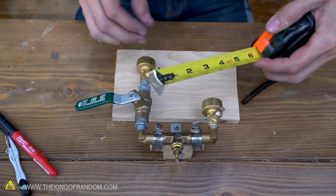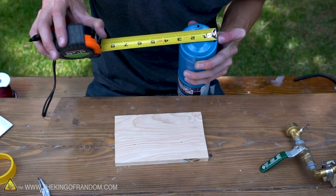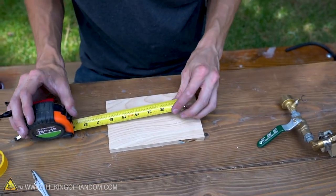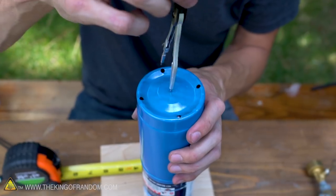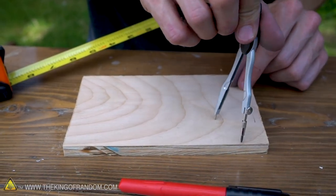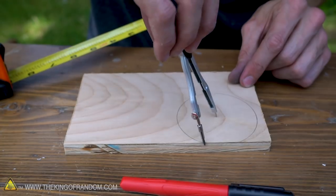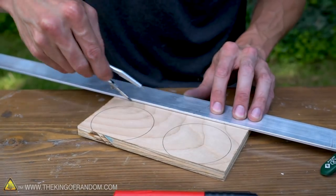We're just going to cut that out of a piece of wood. Looks like about 2 and 13/16 inches is the diameter of our bottles. Take a compass, measure out a circle — just the right size. By just the right size, I mean just a hint bigger so that it's not going to scrape and rub. We're going to go for some open circles; they won't be entirely enclosed by the board — open on one end just a little bit. We've also got some extra board back here, so we'll trim that down a bit too.